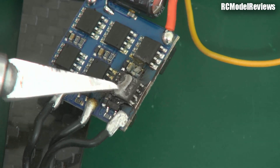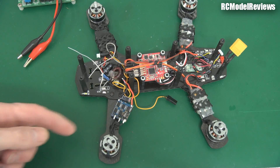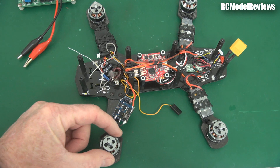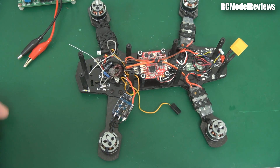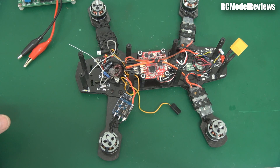As you can see on this ESC, one of the FETs has died. Now one of the problems you encounter if you blow a FET like that — if the magic smoke comes out — then it's quite possible that large amounts of current have gone through the motor. So how do you know if the motor's okay? You could put another ESC on there, but if the motor has gone short, it's just going to blow up the next ESC you throw on. You need to make sure the motor isn't ruined by the short circuit.